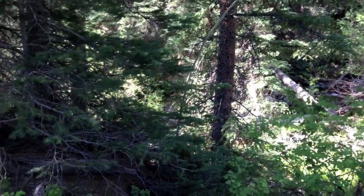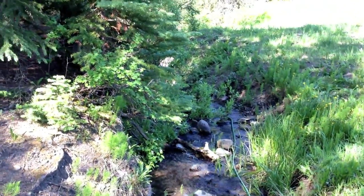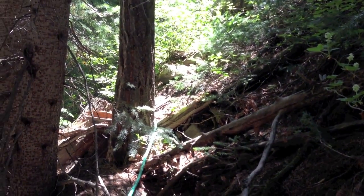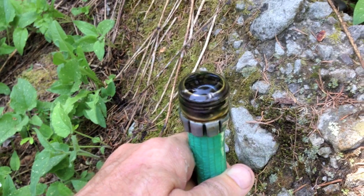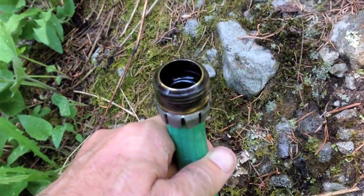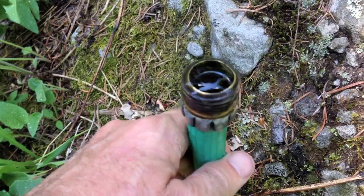Because the trees are so dense where I'm looking to cross the river, I'm going to use a different method here. I'm going to fill a hose at the point of intake and then run it across the creek and find the equal height on the other side. I can get this hose all the way through here and make a mark on the other side of the creek to show me where the height of the water is at the intake. When you reach a point that's equal height to where the water's coming in and going out, you know you're right there at the height of the water. I may be losing a foot or two because of friction in the pipe — it's about 300 feet of pipe.